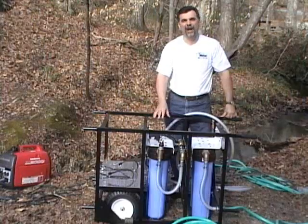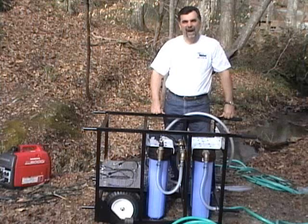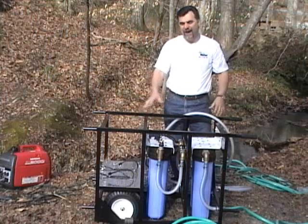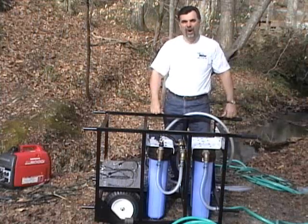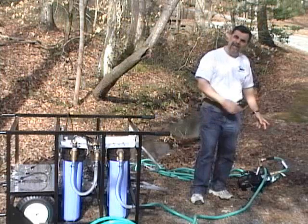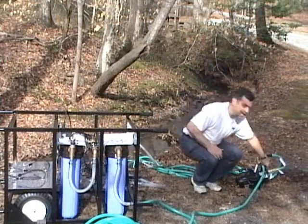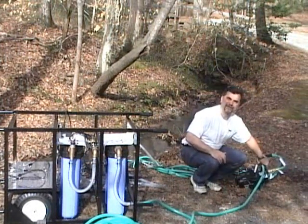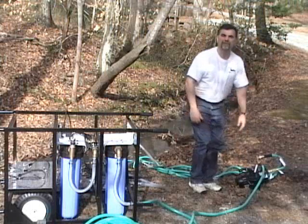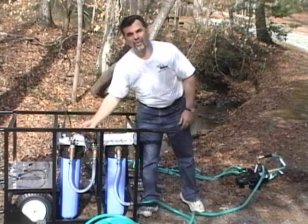The last thing we need to do is plug in the ultraviolet system and the pump. Please bear in mind that it might take approximately four to five minutes for the water to start pumping through the system, because each of the canisters contains a large volume of water and the whole system has to fill up before the water will start to be purified. If your pump does not prime immediately, you need to add a little bit of water into the pump to help it — simply unscrew the top of the pump and pour a little water in. Once the pump is filled with water, it should prime immediately. Once the pump is primed and the water starts flowing through, turn off your manual air vent because the water will come shooting out of it.